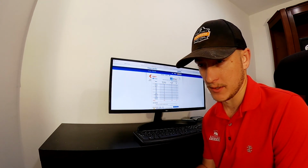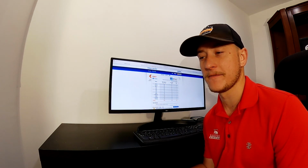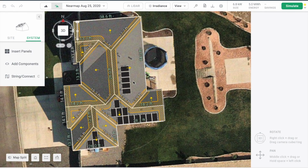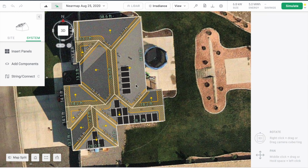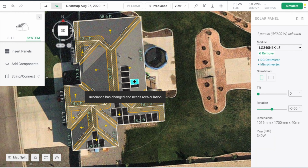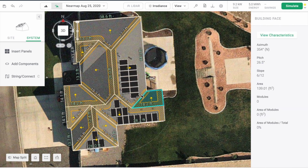On this solar installation, we had 20 panels. Each circuit could handle up to 15 solar panels. We had a circuit of 12 where we added those 3 panels landscape, and then we had a circuit of 8 where we added 7 more panels, and so we had 2 circuits of 15. Right there, we're kind of maxing out the system. We didn't have to update any wiring in the attic, didn't have to upgrade the inverter. It was relatively easy just to tie into those circuits and add those panels.